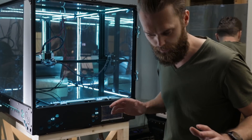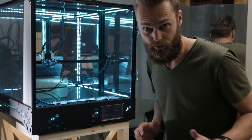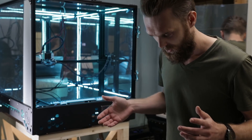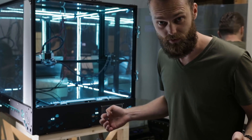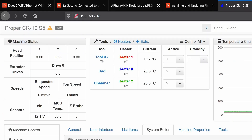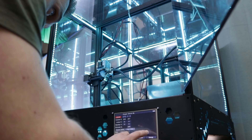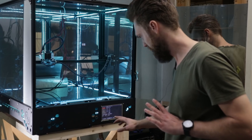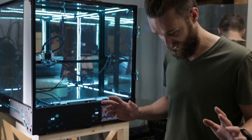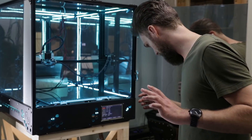I had to tweak the temperature settings a bit for this DICE extruder hotend. At first it showed a temperature of 2000 degrees, which is a bit on the high side. So I checked the documentation for once and entered the proper settings. The temperatures look alright, so the only thing I've tested is the fan - if I run it, then this small fan is rotating. I should be able to home the XZ axes and I hope it works. I've checked the wiring.